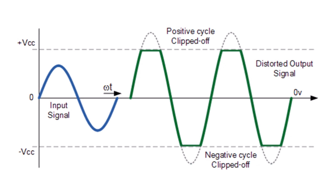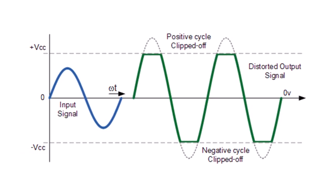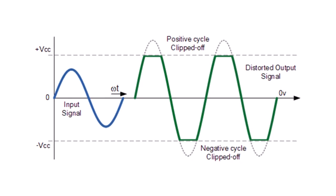This once again brings us back around to the concept of headroom, which is a term I use a lot on this channel, and we talk about it in several ways. We'll say maybe this amplifier's clean channel has a ton of headroom, it'll never distort, but you compare it to this amplifier's clean channel and it doesn't have as much headroom, because at the same volume it's starting to clip and break up a little bit.